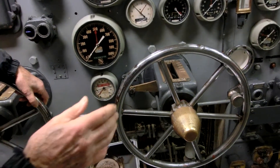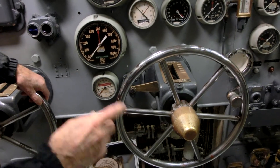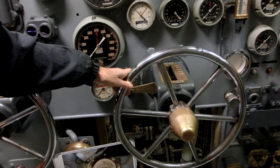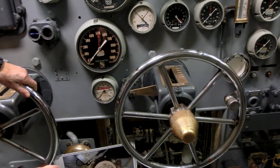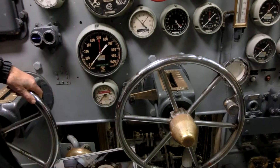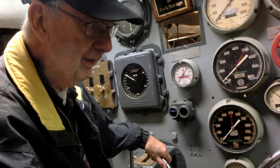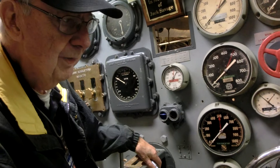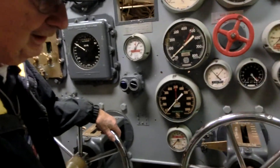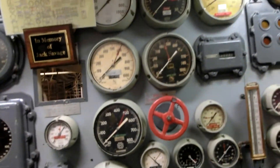It'll take about 45 minutes to actually slow down and stop, and if you leave it on long enough, the propellers will start turning backwards. But usually they use that just as a convenient place to dump excess steam. When running at full pressure and wanting to slow down, there's no place to get rid of all that steam. So they signal the boiler rooms to cut back temperature and make less steam — but while that's happening, they dump the excess into the stern system. It's enough to help slow the ship down, but won't stop it. If you leave it on for about an hour, it will stop the ship and start backing up, but they almost never did that.